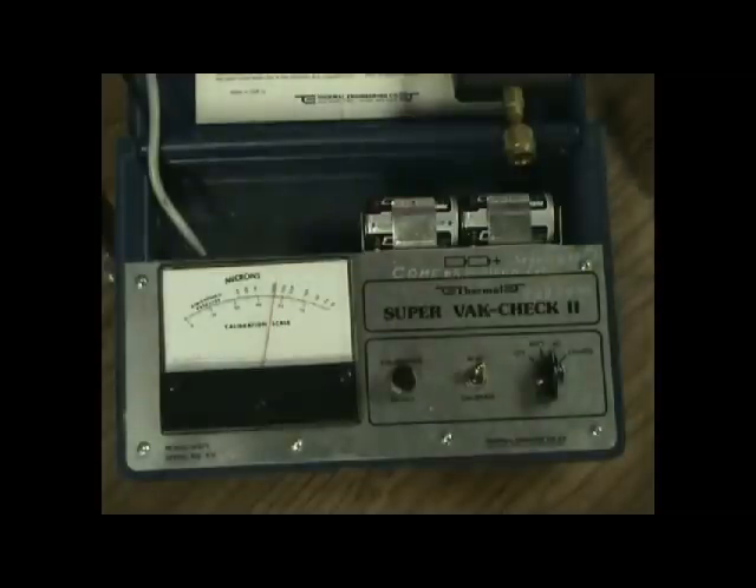It's actually a linear measurement, not a pressure measurement. Originally we used inches of mercury, but because inches are very hard to divide into very small pieces, we switched over to the SI side and it's normally given in millimeters of mercury when you see it published in papers. A micron is just another division of the millimeter — one one-thousandth of a millimeter.